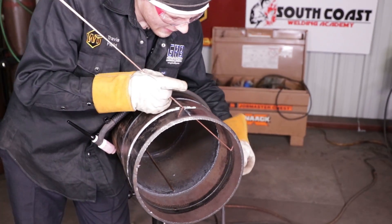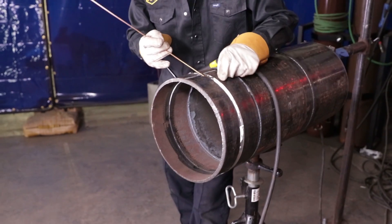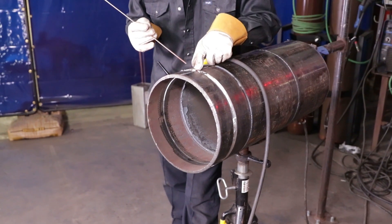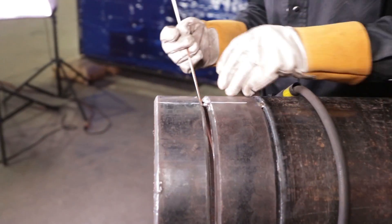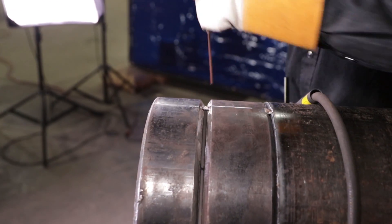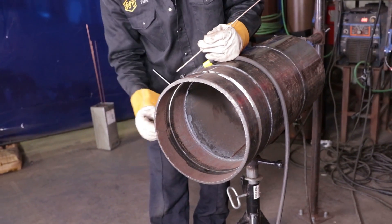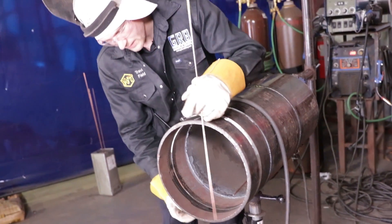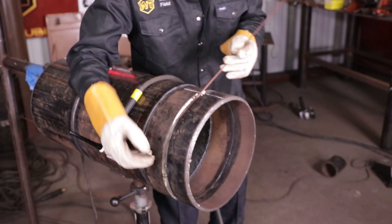I'm going to reach over and pull the root bead — the weld puddle — up towards me, because it's easier to pull the weld puddle up towards me to about 12 o'clock than to stand on this side and try to reach over. When I weld from here to here, this tack will be removed out and I'll be back-feeding from around here. When I weld up to 12 o'clock, this whole half side will be done. I'll switch over to this side, feather that start, cut the tack out at 9 o'clock, cut the 7 o'clock tack out, feather the start, and do the same thing on this hand side — welding up to about 2 o'clock, then come over to this side, thin out the start, clean up the top, and close it.